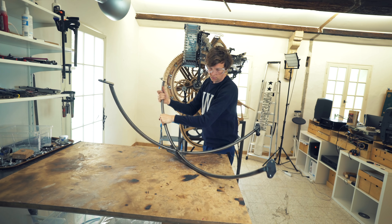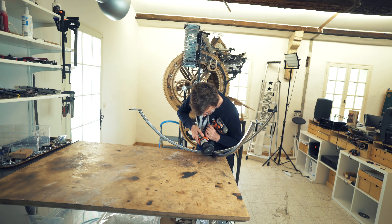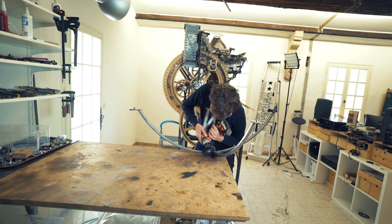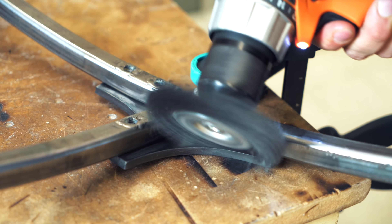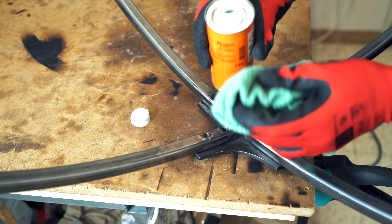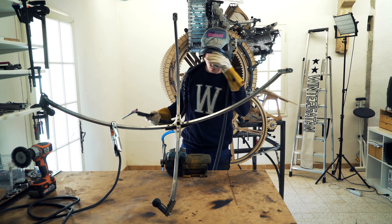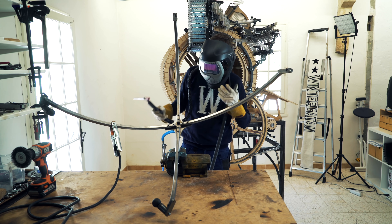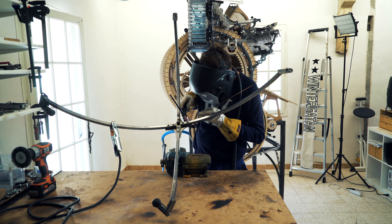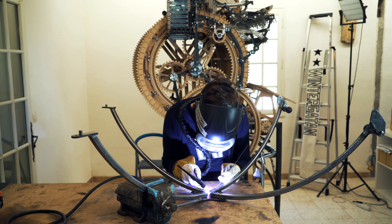We kept the X bracing disassembleable for the shipping, but now that we see everything fits, it was time for me to weld it rigid. I really didn't want to mess up the beautiful work from JD and Marius. So I did some proper TIG welding preparations: cleaning the metal with a brush and acetone, having a clean tungsten tip, and also a good working position. Since I'm the third person TIG welding on this assembly, I thought I would try to match my weld beads with the others so they wouldn't stick out too much.